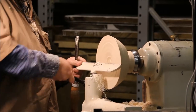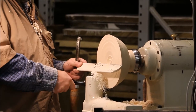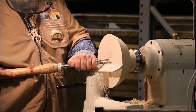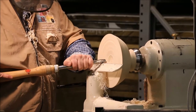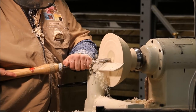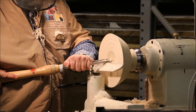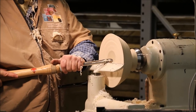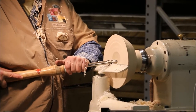The tool rest is too close, so I'm not going to cut across the middle on center — I want to cut right across the center. If you have the tool rest at the right spot, you should be able to glide right across the middle. You should just cut it right out of there.